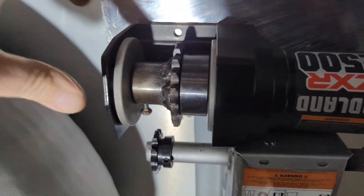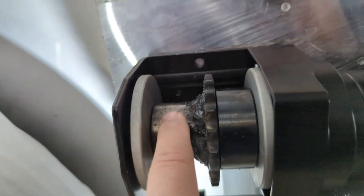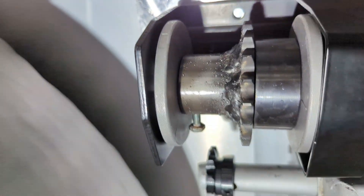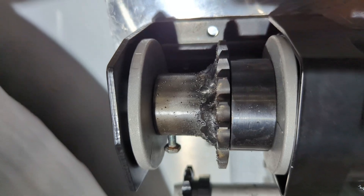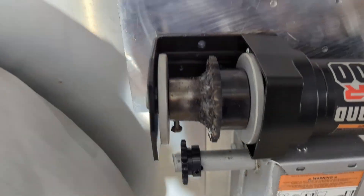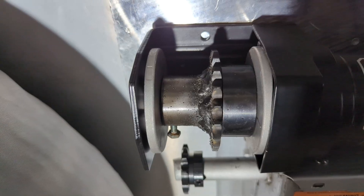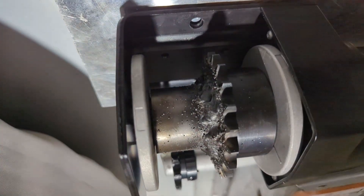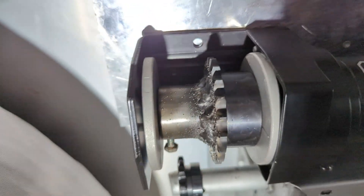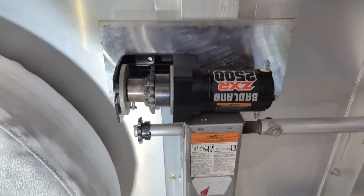We're about ready for testing. The drum pieces were separated — I drilled and tapped the spacer piece when it was off, and put in a set screw so the drums are held together again, just so the bushings will take the strain off it. Part of this was because I didn't bring my MIG welder — I re-spooled it for stuff like this where looks don't matter and use flux core wire. Of course it splatters a lot. Number one, I'm not a good welder; number two, using flux core wire. But I believe it's plenty strong for the job. Get it bolted down and see what happens.